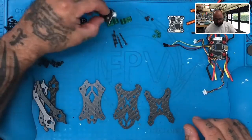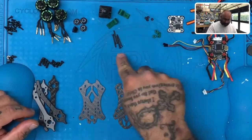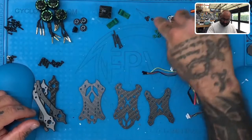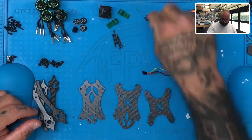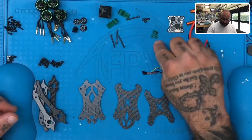We have your camera right here. This is going to be used if you're wearing goggles or want to watch your flight on a TV. We've got the mounts for that. These are M2 20-millimeter screws, which are going to hold in your flight controller and everything else. These are your M2 fasteners that go on top when we're done fastening everything together. And these are your spacers.